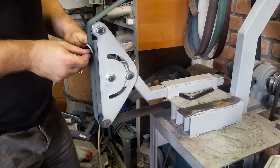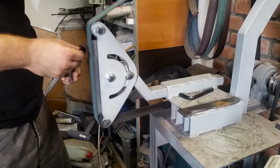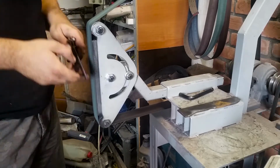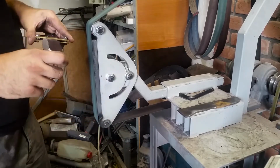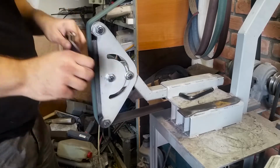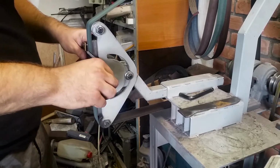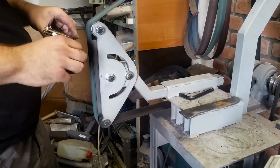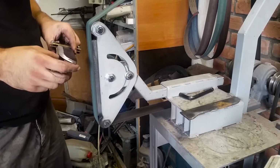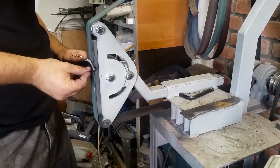And yeah, this is something that just helps me, and as you can see, I'm not doing long strokes over the whole blade, just like I did in the previous part when I was grinding the first guideline, just because I didn't want to screw it up and I was worried that I will. So I first try to grind the straight part of the blade, and then I'm going for the tip that is sweeping up. And this is just easier for me, it's not perfect, and I'm trying to correct that with nice long strokes all over the blade to see if the belt is taking material evenly and if everything is even. And I'm checking constantly if the bevel is relatively straight, and I'm trying to constantly cool down the blade,